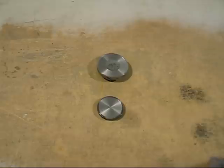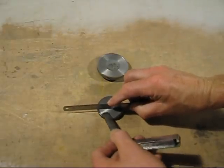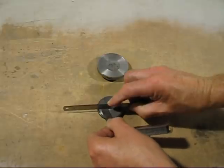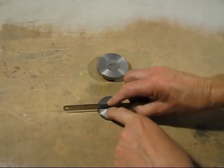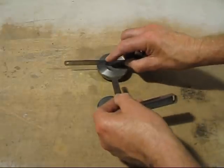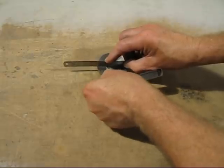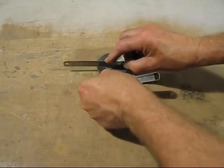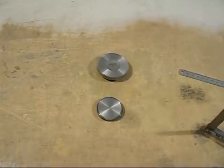Now we'll have a quick look and see what happens when you machine a soft metal with a hard metal. See the file going in there? It won't go to the edge. So the soft cast iron machines, and it tends to deflect off the really hard white cast iron. And the same with this one here. Come on. Yep, it does the same thing. So it's very hard to get a flat surface, so these castings are a reject.